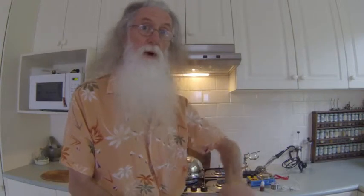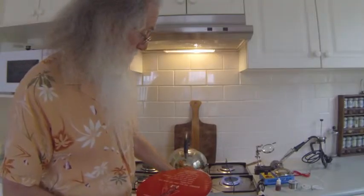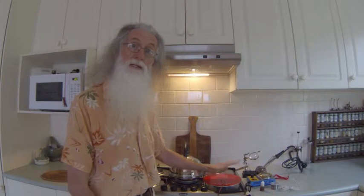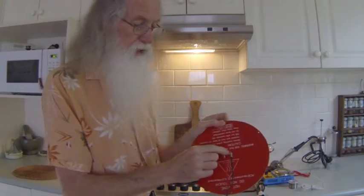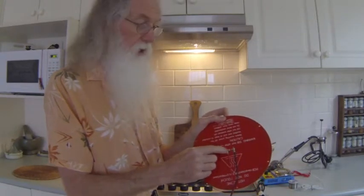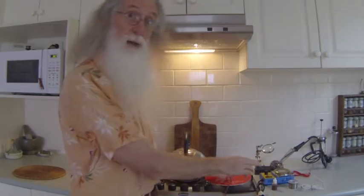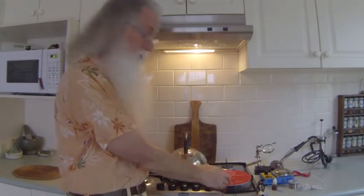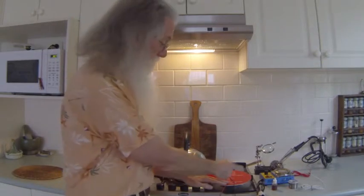Once set up, to heat the aluminium you can use a heat gun, wrap it in a plastic bag and pour hot water on it, but the idea is to get the aluminium up to working temperature. I turned on the gas stove and sat the plate on there, left my hand on it, and as it got hotter I knew it was at temperature. I put a tiny drop of flux and smeared it with a matchstick onto all three pads — if it bubbles, it's too hot.